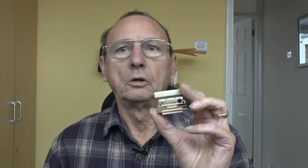With aluminium, the swarf comes off as a curly bead and it's quite easy to block the flutes if you don't keep clearing the drill every two or three millimeters. Whereas with brass, the swarf breaks up into tiny little chips, so it doesn't block the flutes and the drill runs more true and ends up where it should.